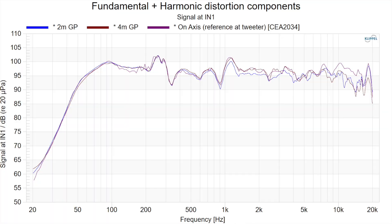A couple of things about this speaker I want to note up front. When I tested it, I wasn't really sure where the reference point was. Tom told me it was at the tweeter. For measurement purposes I wasn't sure if I should use the tweeter or the baffle, so I measured it both ways — reference point at the baffle, and then right in front of the tweeter. I also took it outside for ground plane measurements at two and four meters. The match confirmed the point of origin is right in front of the tweeter, and that's where all this data stems from.